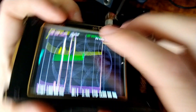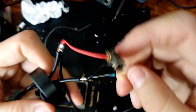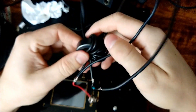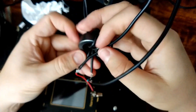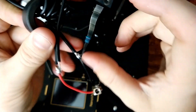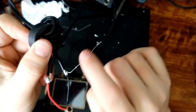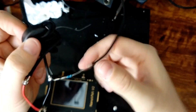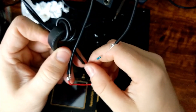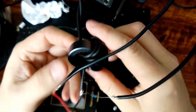So for 80 meters and up, this transformer is okay with five turns - six turns didn't really make much of a difference. Two different options for transformers. The plan is to go to parents' place today and try setting up the portable antenna. Instead of the load resistor, the antenna goes between these two points - this will be the ground or counterpoise and this will be toward the main element.